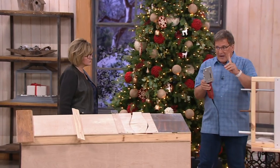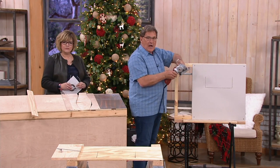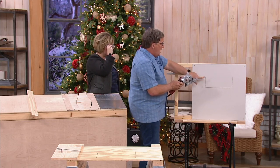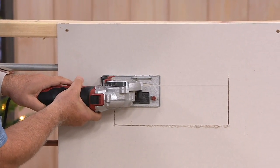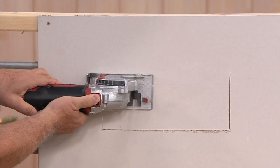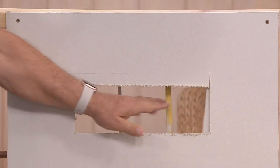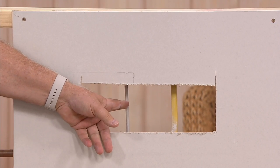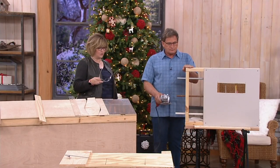I'm going to do a real project. The blade is not exposed. Now I'm going to make the blade go a little deeper, but not too deep because we don't know what's behind drywall — could be cords. I'm going to place my Roto Razor here. Nothing's happening until I turn the power on, and still it's not exposed. Now watch: I can plunge right in the middle of the drywall. That's huge — to be able to plunge right inside the project. And by the way, there is some cord back there. That's why you don't want to experiment with a sawzall that goes deep in — with this one you can control how deeply it goes.